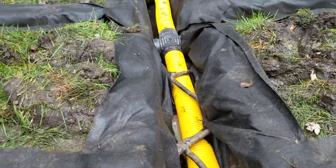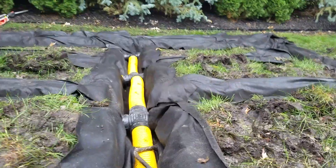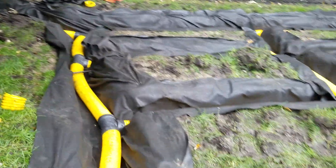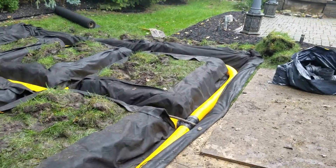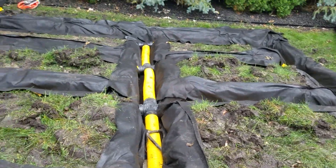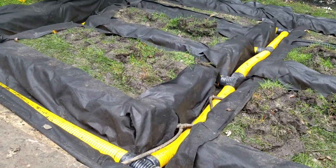Notice how there's no inlet basins. Why are there no inlet basins? Because you don't need any — they just end up filling the system with contamination. When you have bark mulch and grass blades, all this organic material that just turns into great topsoil or planter's mix, it doesn't work well when it's in your pipe.